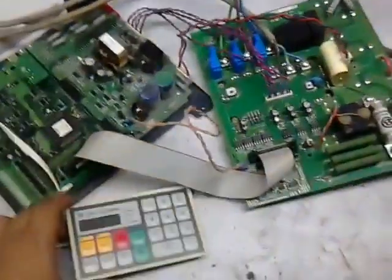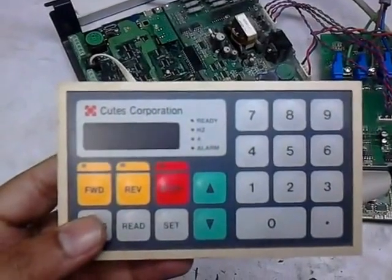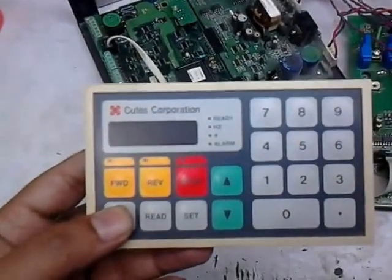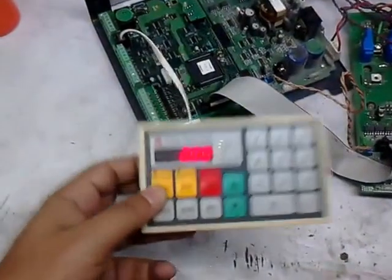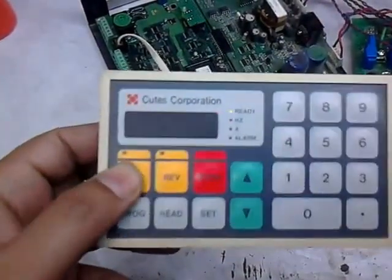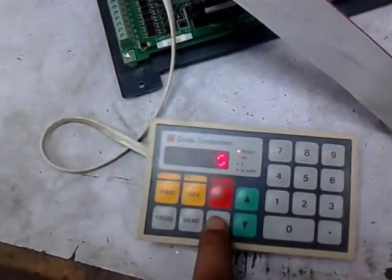Okay, now we will turn on the drive and we will see the behavior of the drive. So this is a simple keypad, and you can see how to check the drive by applying the default setting, and in the description you can see how to apply the default setting. Okay, drive is on. We set the initial frequency to 2 and we will press the forward button, and now the drive is turned on. Okay, it's giving output. We will increase the frequency, selecting 5, press set.